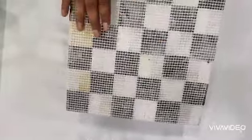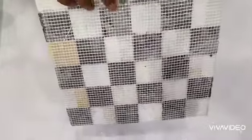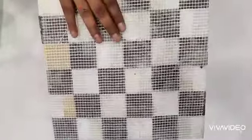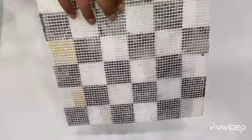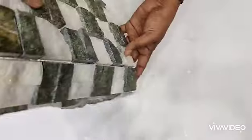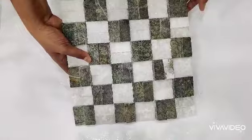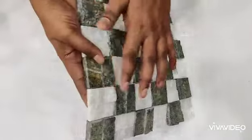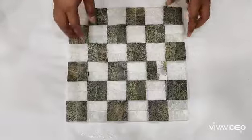When we apply it on the wall, we paste the adhesive here. We recommend white adhesive to fix this on the wall. If you are fixing it on ply, a different chemical is used, but that is also white in color. White color is recommended because the color of the stone will not change once installation is done. These are all natural stones, so whatever we apply on the back side may reflect on the front side — that's why white adhesive is required.